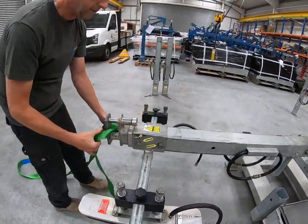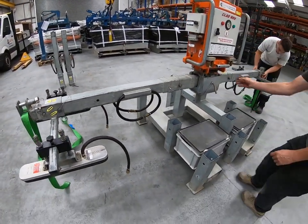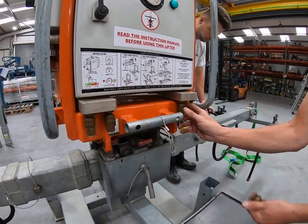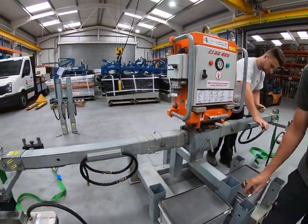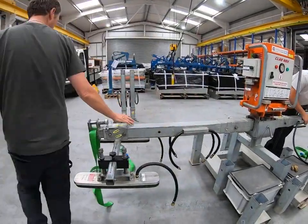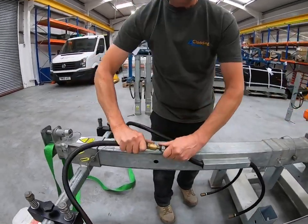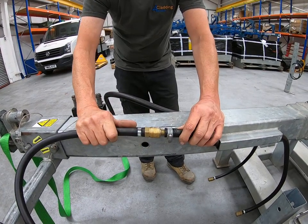All the components need to be pinned and locked into position with the R-clips. Then you need to connect the suction pad hoses. When the machine arrives on site, all four vacuum outlets are blanked off with blanking plugs — just remove those by pushing them up, pulling the collar down, and sliding them off. The hoses can then be clicked through from the suction pads all the way to the machine. All the couplings are on quick release — to put them together, just click them so you hear a positive click and they're located.